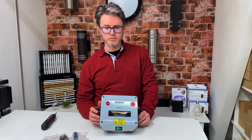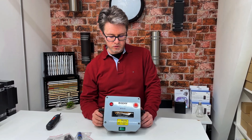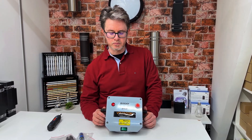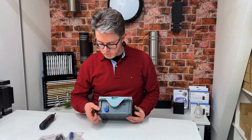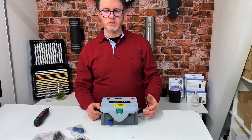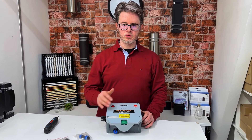If there is a fire or extremely high temperatures where you install the inverter and the solar panels, this isolated switch is going to disconnect your solar panels from generating any useful electricity. There is one AC plug here and the AC adapter. You can connect this to the mains and if there is loss of mains, this box is going to detect that there is an issue with your system and your solar panels will be disconnected automatically.